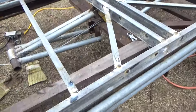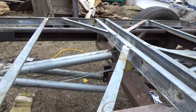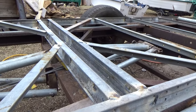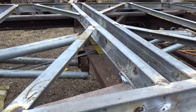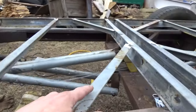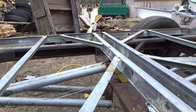I strengthened the trailer and all the cross members. Then I went ahead and started working on that lift mechanism — a little bit of engineering took me damn near two days. Anyway, it's a scissor lift. It works off a winch in the front: when the winch pulls, it closes the scissors together and lifts the bed up. Easy enough, until you try to figure out how to do it.